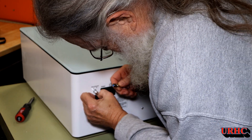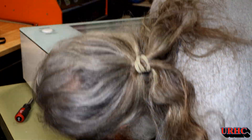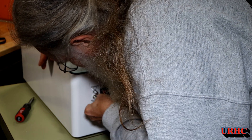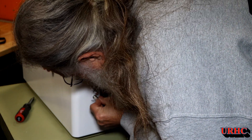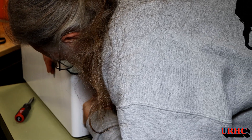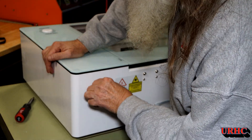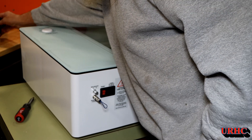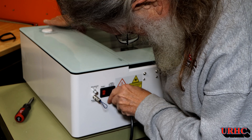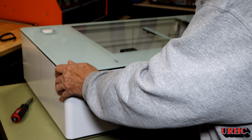Big bonus: you get five sheets of three millimeter basswood plywood, some three millimeter cardboard, and three millimeter acrylic sheets, which is quite expensive these days. Now I'm going to start setting up the back of it. The first thing is there's an interlock key — it's a safety device so you can't run the unit without it. If you have kids in the house, leave this off. You just snap it in place, push it in, it snaps and locks. Then there's a knob you have to turn fully clockwise to allow full power. It came with a 110-volt power cord.